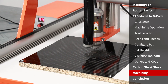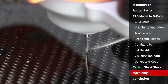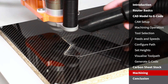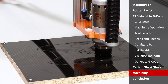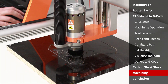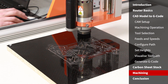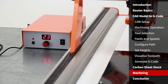To keep dust and chippings down we're using a vacuum cleaner — while not ideal, this provides a better view of what's happening. Occasionally during a pass you will see the cutter lift slightly and resume the cut — this is where the tabs are being left in the stock to keep the off-cuts in place. With the brush fitted and local extraction turned on, you can see how clean the cutting operation becomes. The dust extractor is an optional extra from Stepcraft but one we'd strongly recommend when working with carbon fiber. This particular cutting operation took a little over three minutes in total.